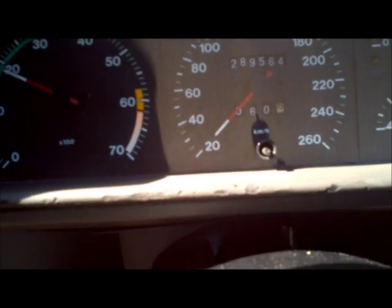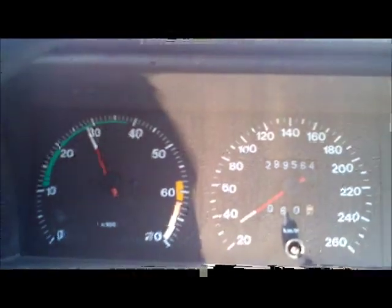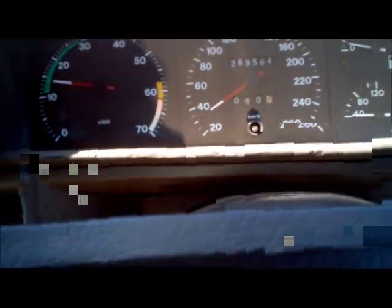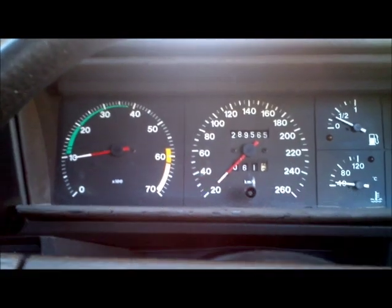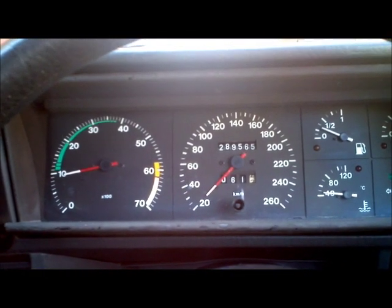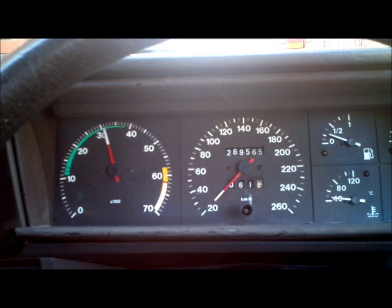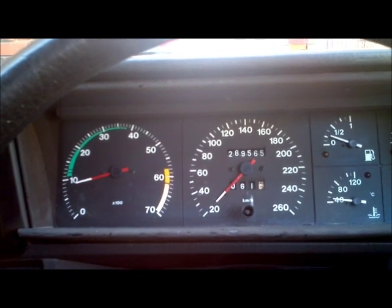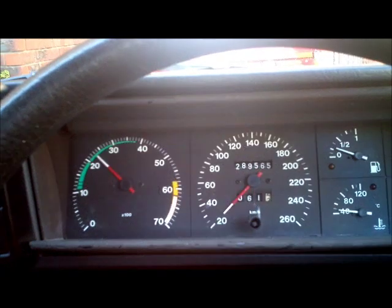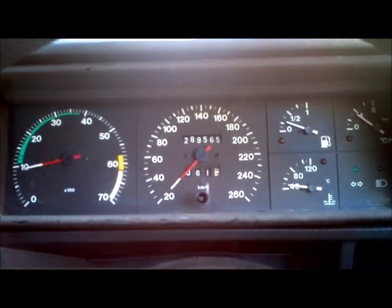Around the road in first gear — we set the soft limiter to be at 3000 RPM, so if we rev up to 3000 RPM you can see it's a bit violent but it's definitely cutting. Just took the car out for a run and tested out the soft limiter — it's a bit violent set at 30 milliseconds. It's cutting in at 3080 RPM and then resetting every 30 milliseconds. So there we go — successfully changed the soft limiter on the Alfa 75.